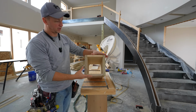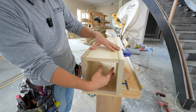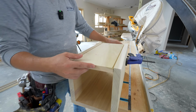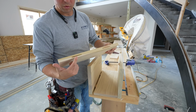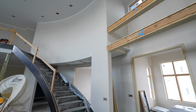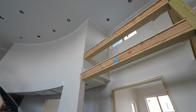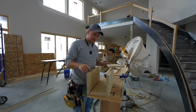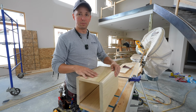This is a mock-up of the header detail and basically the wrap that's going to go around it. The framing material would be on the inside here. You'll notice I've got a little rabbet detail on this board, and then our side pieces are going on, and I've got slots mortised for biscuits here, and you can see that on my pieces that are already up there. Basically all I need to do now with what I've already got installed is to put the side pieces in place, and again those side pieces will have identical biscuit slots, so we'll just push everything together with some biscuits and it should snap in place pretty well.